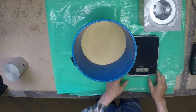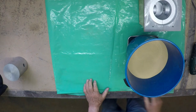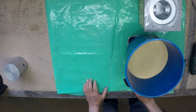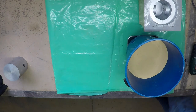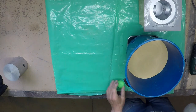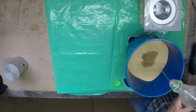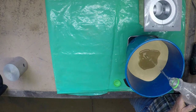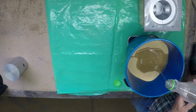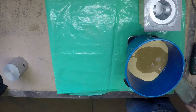Now I'll add the required amount of silicate - get that on the scales. I need 7.5% silicate in 5 kilos, so that's 375 grams, which is a fair bit. About 380 - close enough. That's a pretty strong brew, but I like it a bit strong.